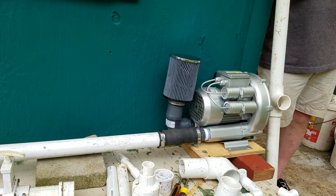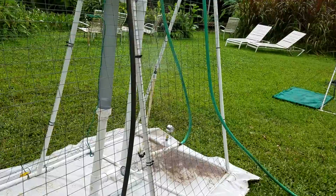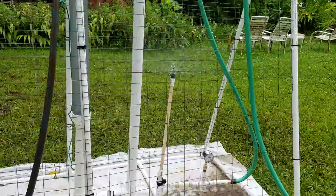What I get out of this regenerative blower is that at 50 inches I get 20 cubic feet per minute. If you look at the catalog chart and go down to 40 inches, you roughly double it — about 30 cubic feet per minute. Go down to 20 inches and you get 40 cubic feet, though it's getting piddly. But this is working right down to about 30 column inches of water.